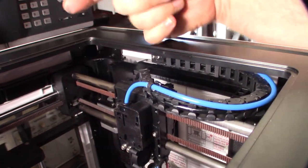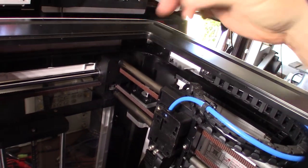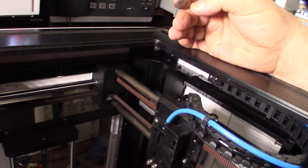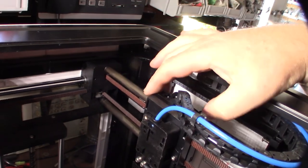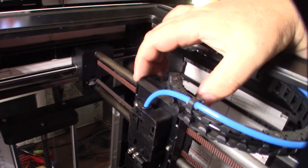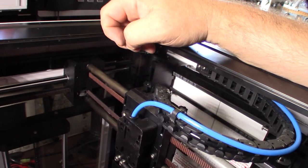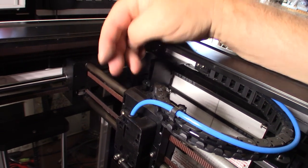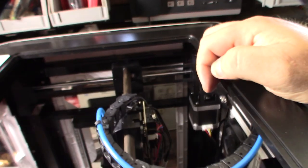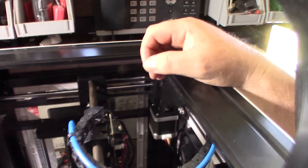The carbon rods are a bit dirty so I'm going to clean them with rubbing alcohol. You shouldn't lubricate these rods — I use oil-impregnated bronze with graphite inserts on my other printer. You don't want oil to leach into the carbon resin and deteriorate it.